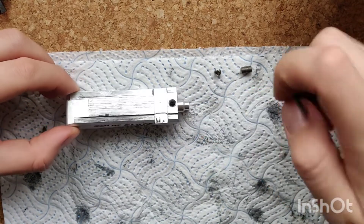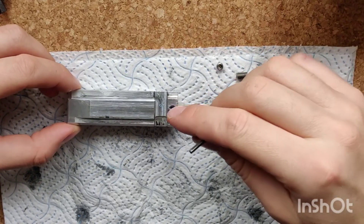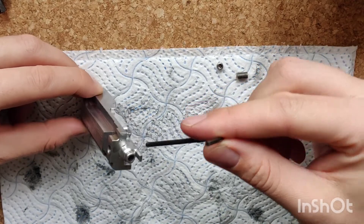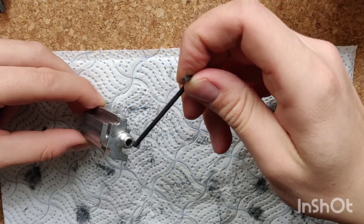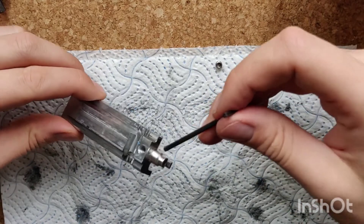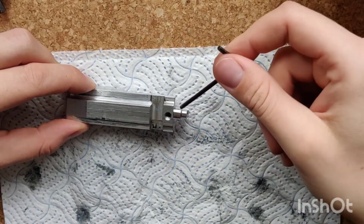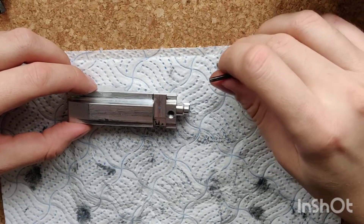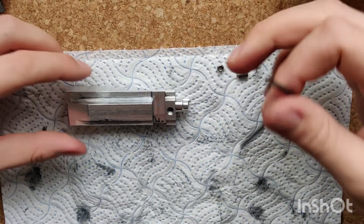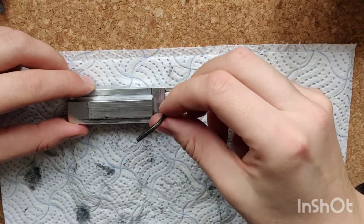But the problem with this is why we have different size screws. This outer grub here is an 8mm, and then you've got the 4mm locking grub already explained. The power screw currently in here is 6mm long, and you don't really want to be using that when it's wound all the way down to minimum, because the 6mm screw will basically just be hanging in the bore of the nozzle, not supported very well by any threads. It's possible that it will be rattling around, and gas could leak behind the screw — even when you put the 4mm locking grub back in, there will probably still be gas able to get between the power screw and the locking grub, so you might have some loss of efficiency with gas leaking up out of the power hole.